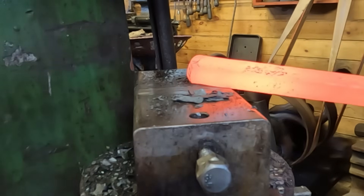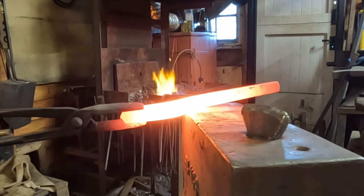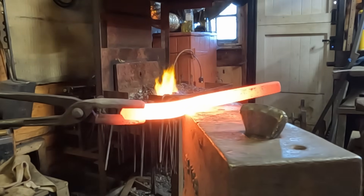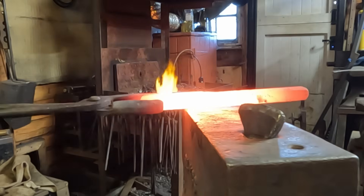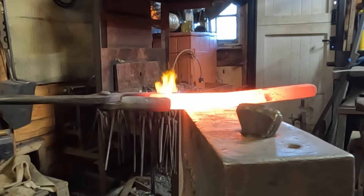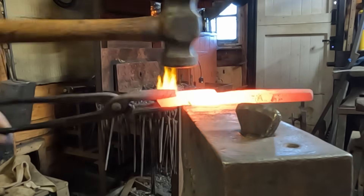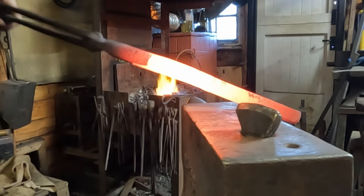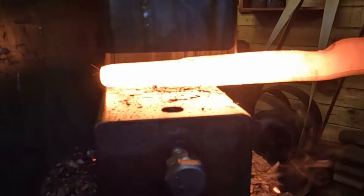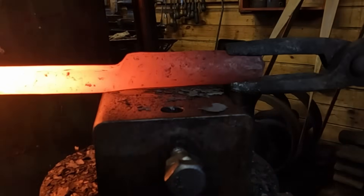After checking the dimensions I move to the anvil to forge a set down, which isolates material for the head of the key. I'm forging this part for a couple of reasons: the first being that a forged part is always stronger, but also because my shop is much more geared towards forging and my old machines and tooling aren't going to stand up well to hogging off a lot of this tough steel. So I'm forging down to as close a dimension as I dare, checking off and on with calipers.